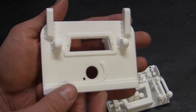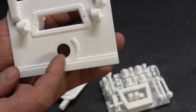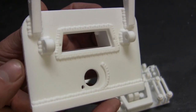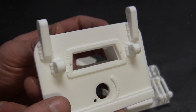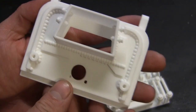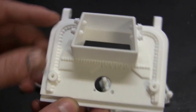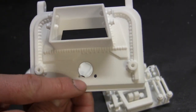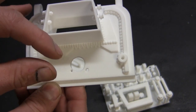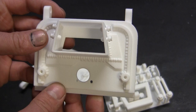For the top hatch, it's a little more detailed with its outward appearance. We have a gutter-type drain guard, more weld beads, the mount for the ballistic glass, counterweight spring mounts, as well as the main hinge mounts. On the interior section, you can see more little latch mounts on either end, and this is for the pistol port. There are also a few other holes for the various mounts and clips used to keep the unit in place, which I'll touch upon once the units enter production.